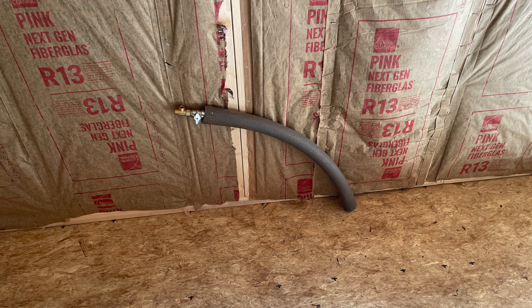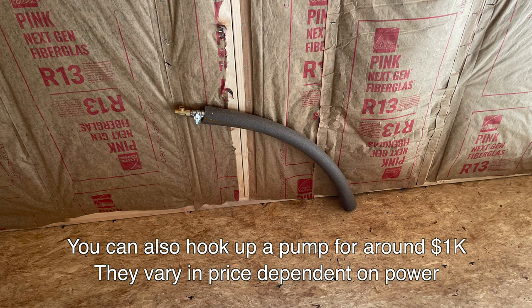Additionally, I had water hooked up to this piece of land. And you've got to consider the cost of all of this, especially if you're buying raw land. Do you need a septic system? Can you hook up to sewer? Is your sewer on a flow system? If it's on a flow system, you need to have your shed higher. So, you know, your excrement flows downhill. Okay, so with that said, I didn't hook up sewer to this, but I did hook up water.